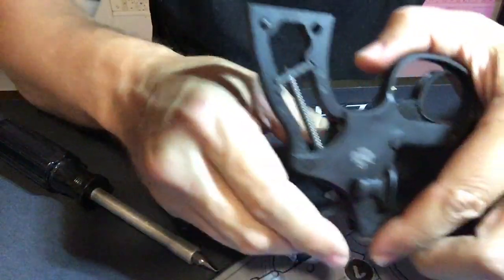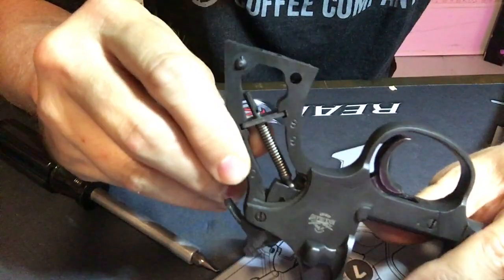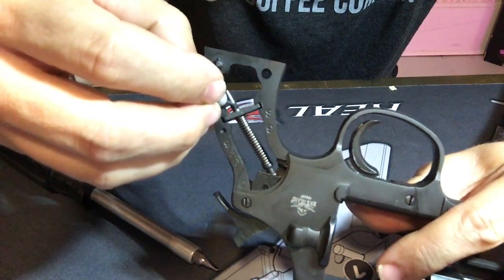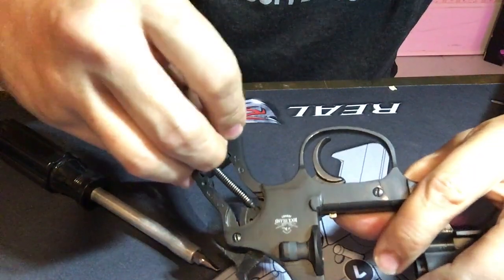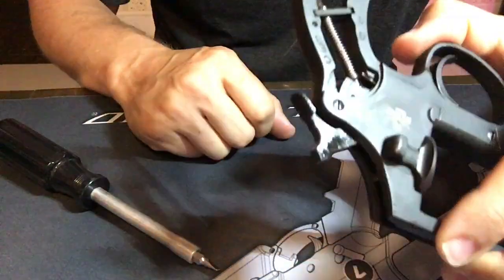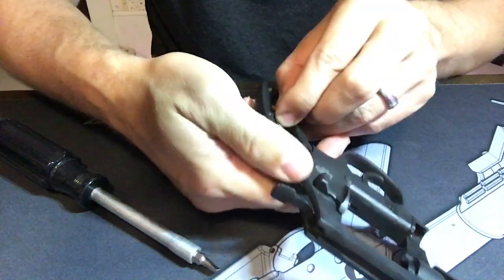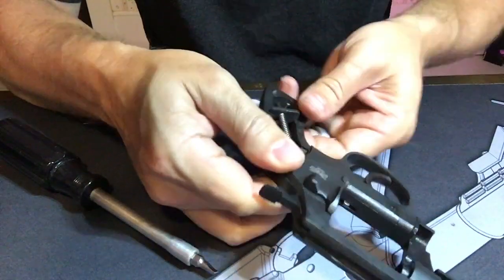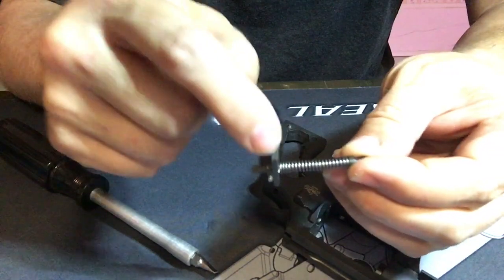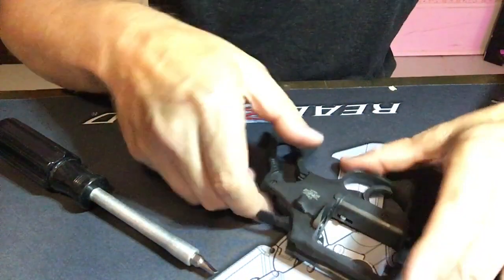It's a tight fit. The main spring here — if you cock this pistol back at this point, there is a hole in the shaft here. We're going to put a pin in this before we take it apart. We're going to release the hammer. That takes the spring tension off. I can slide this out as one piece. I could take this off as two or three pieces, but then I'd have to compress the spring to put it back on — this is just a slight bit easier. Now we have a hammer; it's only under light tension.